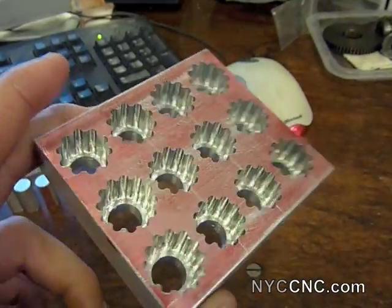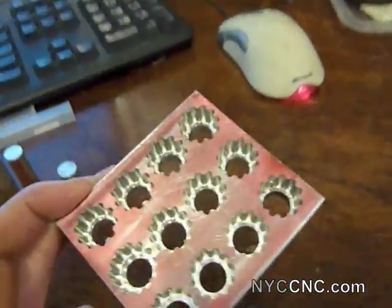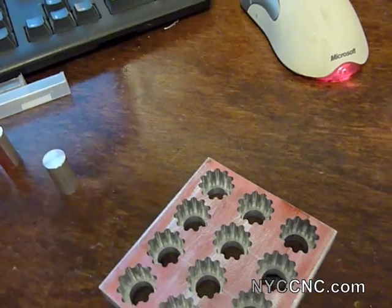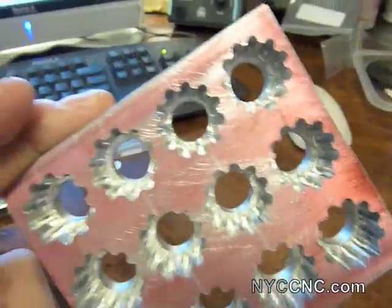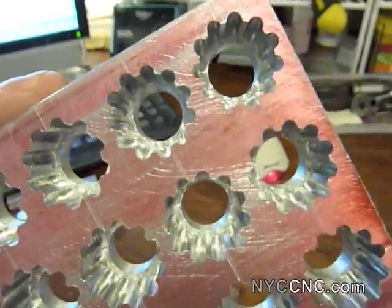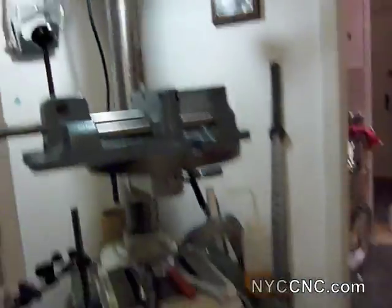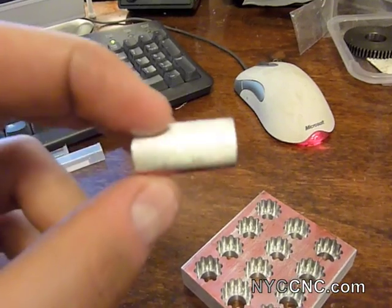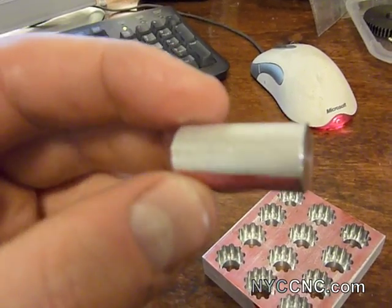Here's the mold — I have milled it out. My next step is to ream out the holes that protrude all the way through. I milled them slightly undersized because my mill has some backlash, having acme screws rather than ball screws. So I left a few thousandths and I'll ream them out to a .499 reamer, which is a half thou under, because these little aluminum shafts I'm using are extruded aluminum, and I measured them with a micrometer and they are slightly undersized as well.